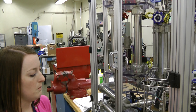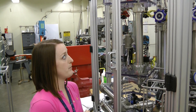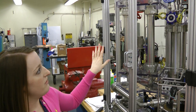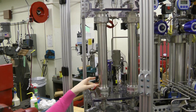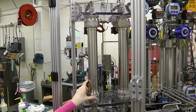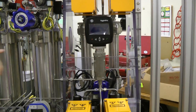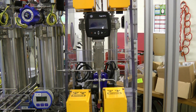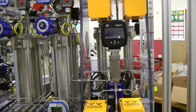This system was specifically designed to produce propellants. The oxygen produced is going to go to oxygen storage, and the hydrogen produced is going to go to a metal hydride storage. Each of those has a certain specification for purity and water content, so we have two drying sections. This section right here is the hydrogen drying section — two desiccant beds used to dry the gas before it goes to its downstream customer. Over here is the oxygen drying section, which uses a regenerable desiccant bed, meaning we will periodically regenerate that bed and remove the absorbed water vapor using sweep gas and heat. These desiccant beds have an internal cartridge heater.